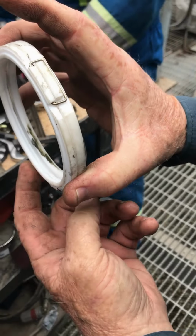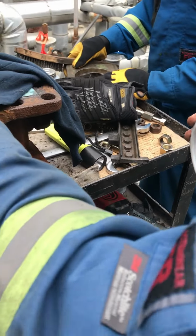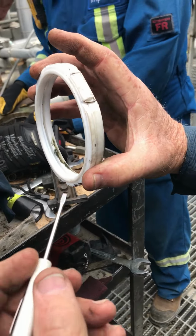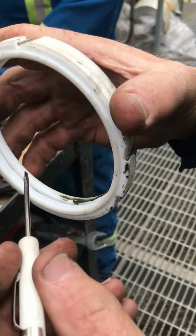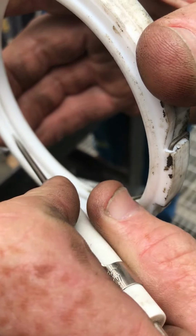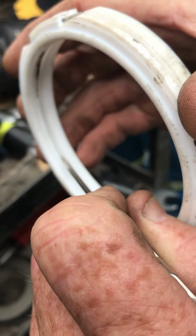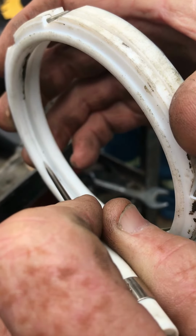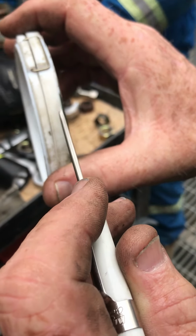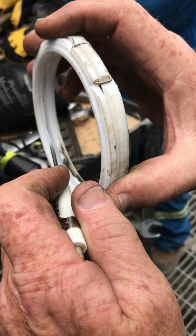That's what it looks like. Where's that little pen? So when it comes like this and it's chipped to you and it's taped up, you'll see that this half here is the upstream. This half here with the seal is the downstream. You can see the difference here. Okay, and you'll see on the outside here, downstream's thinner, upstream's thicker. And the downstream has that seal.